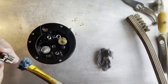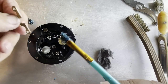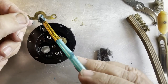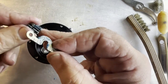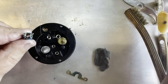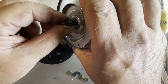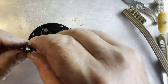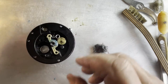With that greased, now we're going to move over to our yoke. They call it a yoke because it kind of looks like an oxen yoke. We're going to put some grease on the center of that where the pinion gear rides. Put that pinion gear in - this opening here goes up because it's going to fit into that position on the spool, so that's going to be up like this because it's going to go against the spool. Set that in place, drop it down inside the hole on top of those two springs.